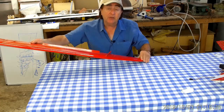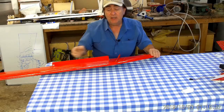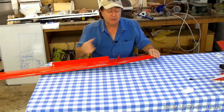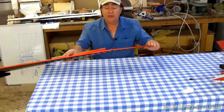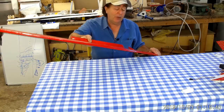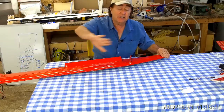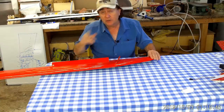They're actually using spoilers for roll control — ruining the lift on the wing to cause that wing to drop and roll into a turn. They have multiple steps of dihedral in it, so they're essentially doing dihedral turns: they create drag, the wing yaws, dihedral picks up one wing, the other wing goes down, and you get a nice rolling effect.